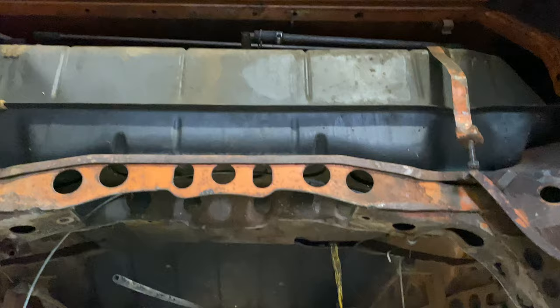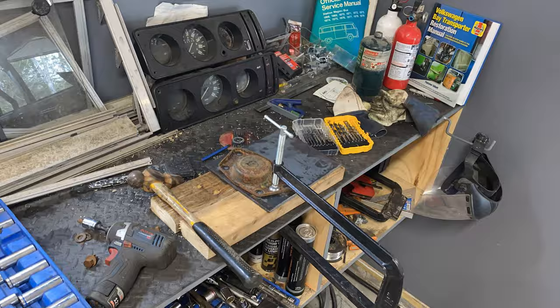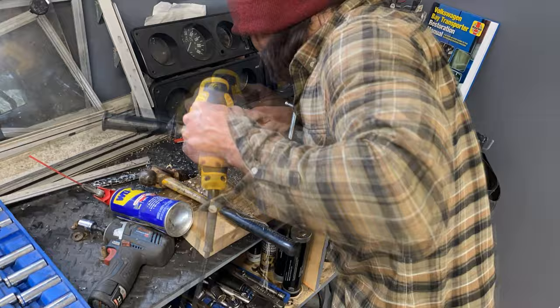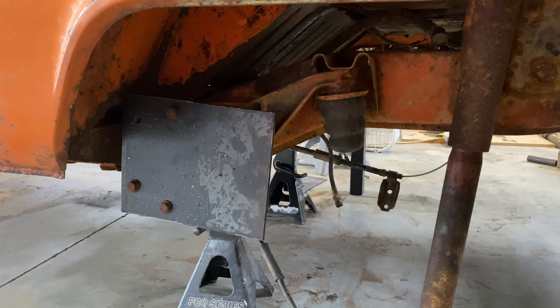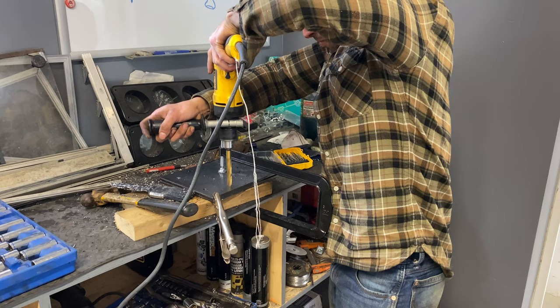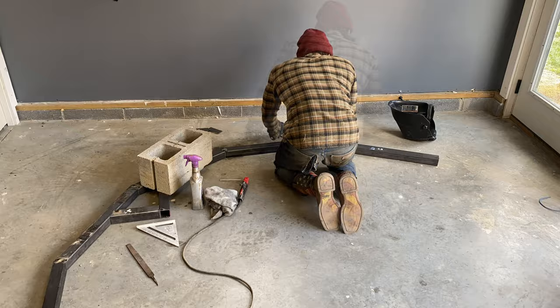Look at all that beautiful amber gas. Now to create the rear frame mounts, I used a dust cap off the rear suspension and marked everything up. The bolts are a bit smaller than the ones up front, but I used the same half-inch drill and everything worked out great. Once I was happy with the fit, I went with the same process of stacking the plates and drilled my other side.